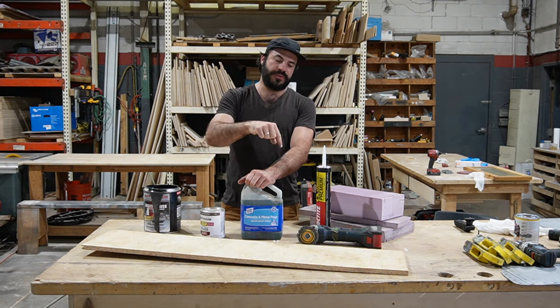You'll remember a while back when I was going over my layout with you, let me grab my tape here, I was talking about how you want to stagger your seams and then also arrange it so you don't end up with slivers anywhere. An example of that: here we've got our second layer of insulation that's going to go down, and this piece is actually going to get in between the wheel wells. You can see I've got one seam here, so this piece here is T-shaped and this piece here is T-shaped. That's really nice. Now, if you're not careful when you're making your layouts, you might end up with a piece that is T-shaped on one side and on the other, so it ends up being sort of H-shaped.